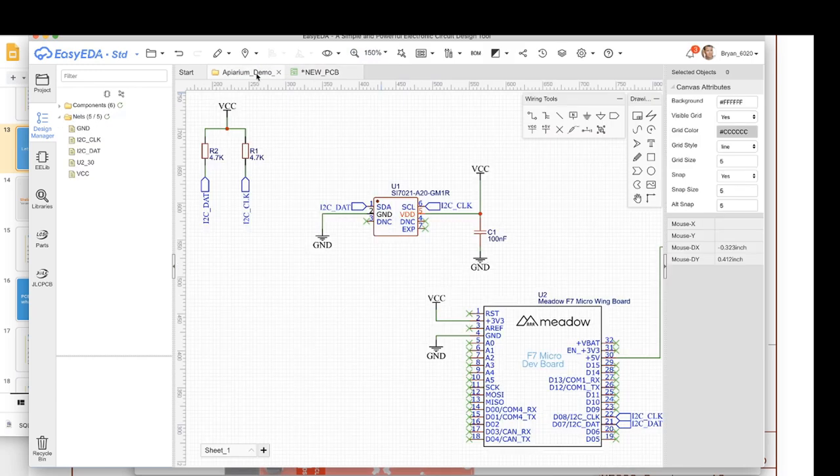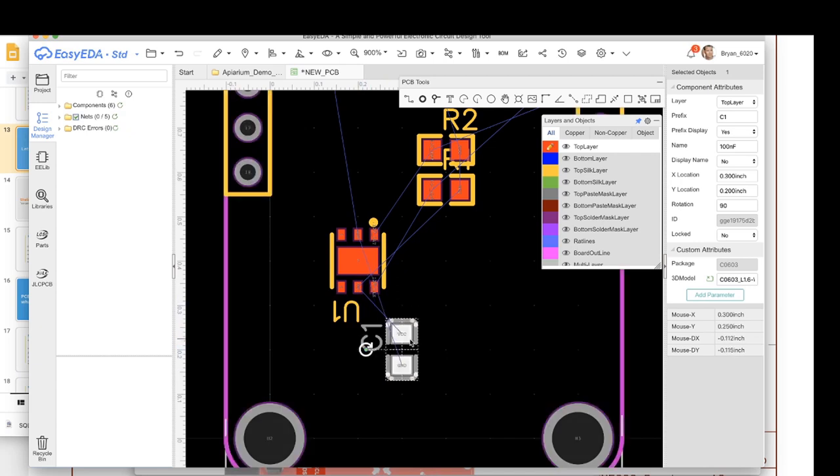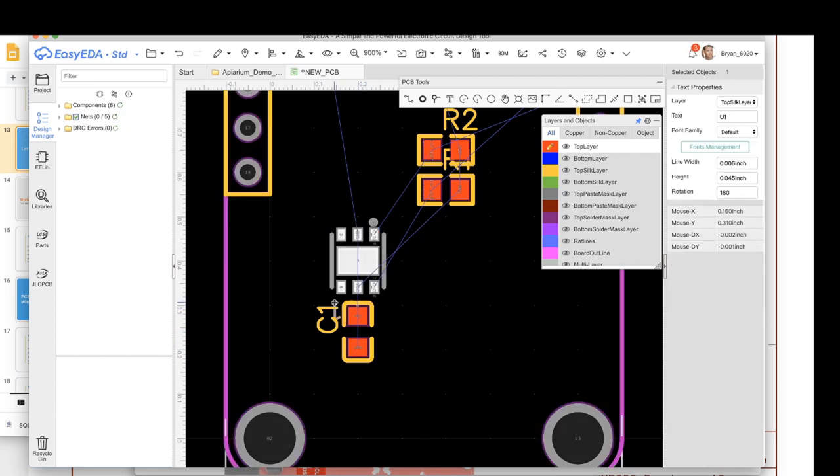And then recall that this decoupling capacitor has to be next to pin 5. And we can see that back over here. It's pin 5. And this is interesting. VCC is actually connected, you just want the capacitor next to it. Think of electricity as pipes and all this is plumbing. You want the pressure to be taken care of as close to the place that's used as possible. So we're going to rotate this like so, or just place it there. And then I'm going to do a little cleanup here. I'm going to grab this, and I'll just put it here.